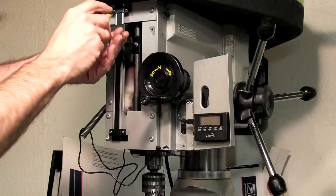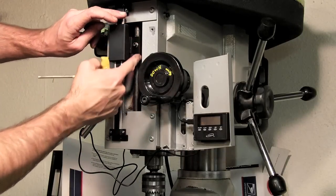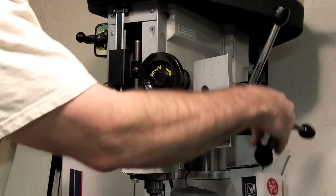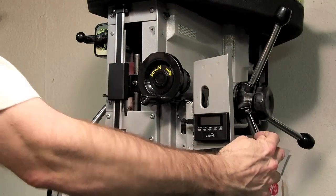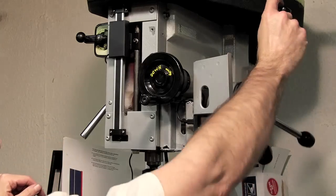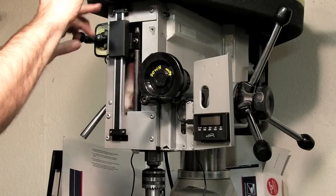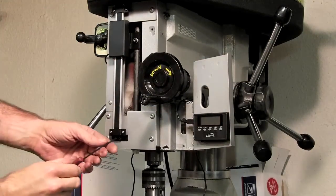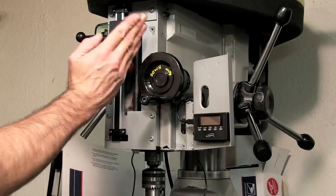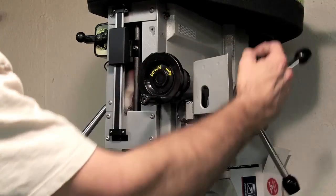You can probably see on this rod — I put it in the milling machine and milled it flat before drilling and tapping the screw hole in it, so the arm that came with the digital readout fits back there properly. You have to run this up and down and check it for binding and motion. The main problem I had yesterday was getting it to move up and down without wanting to pull the slide assembly back and forth. It's because this rod wasn't straight, and that's why I'm shimming it down here — it's the easiest way to get it to come out right.